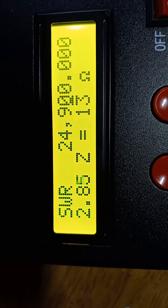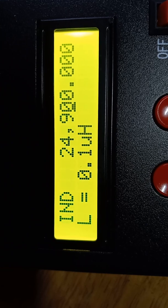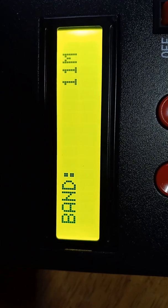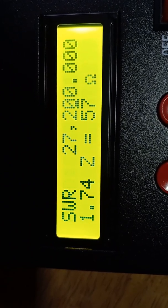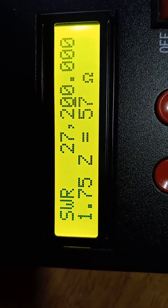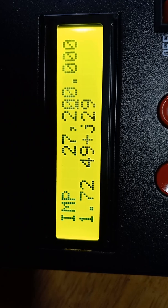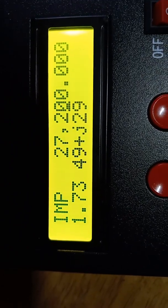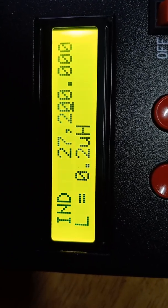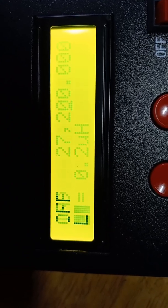12 meter band is a bit high. Going through the modes, we've got 57 ohms, so we're not terribly unmatched. The impedance is 49 plus j29 — that needs a capacitor and a coil of 0.2 microhenrys. I'd have to look that up; I'm not going to pretend to know everything.